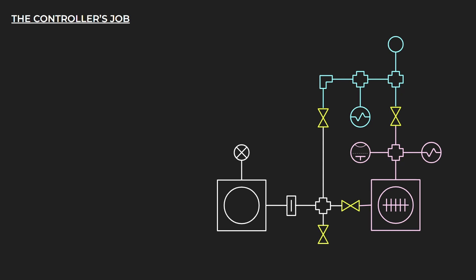So what is the controller's job? Its first job is to sequence the evacuation. When you pump down the system, everything has to happen in a particular order, otherwise you could damage the system. For instance, you can't turn on the hot ion gauge until the turbo pump is running and that portion of the system is already at high vacuum. The turbo pump itself can't be turned on until the roughing pump has already been running and that portion of the system is already at rough vacuum. The same is true during shutdown.